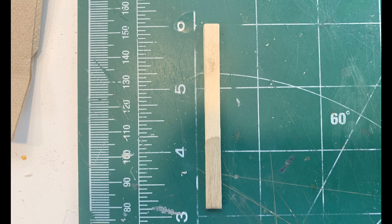It depends how much rust is in the vinegar whether it's going to turn a feathery gray or a darker brown. If you want that feathery gray, just don't leave the rust in there for more than about 24 hours and you'll get that color. It will continue to get darker for the next 24 hours though. At first there's no color to it at all.